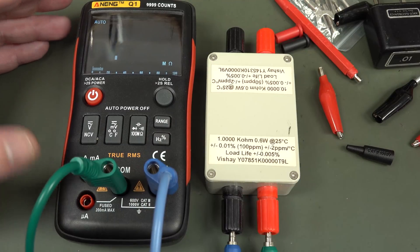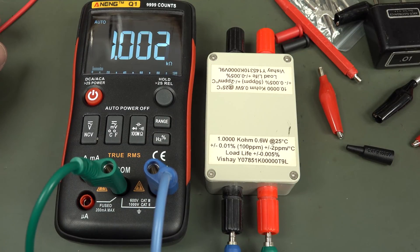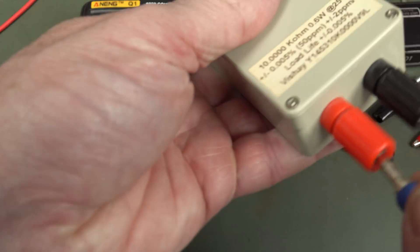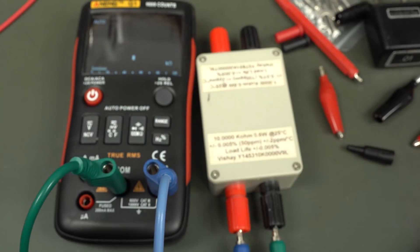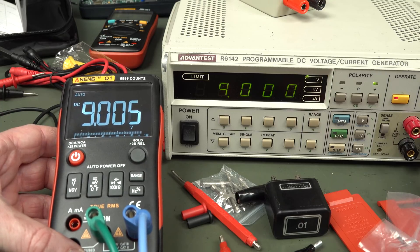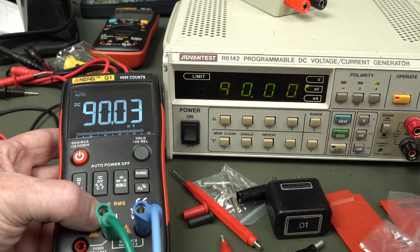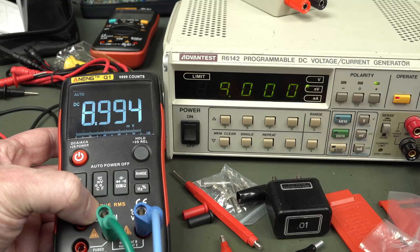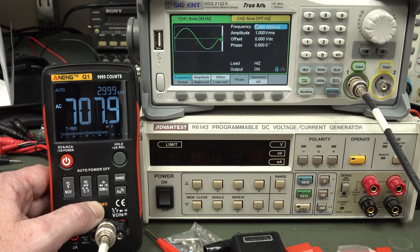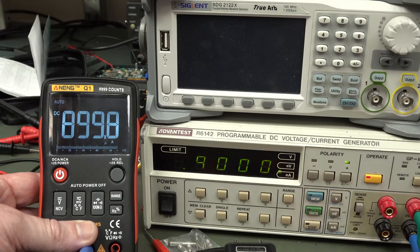Let's measure the accuracy of the ohms. It's creeping down — bang on. That's undershot. The humanity. 10k — let's give it a go. It has some overshoot on the resistance and then does come down — still within spec, not bang on though. Not too shabby. I'll give it a pass. One volt RMS at one kilohertz — no worries. Let's see where the upper frequency is — coincidentally it's bang on three kilohertz.